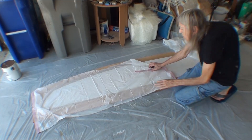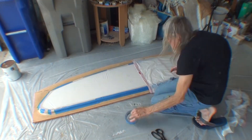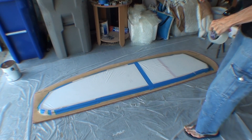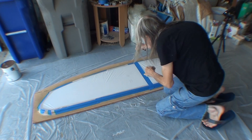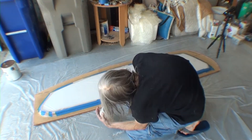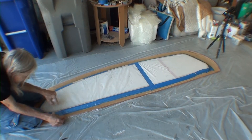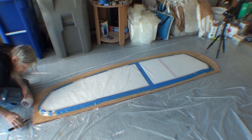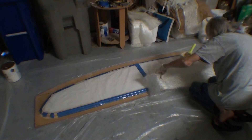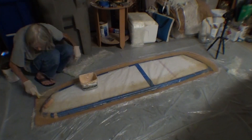I'm going to use a trash bag and some packing tape to seal this, and then it will be used as a mold to make the next piece — the piece that the window will actually go in. It'll conform to curve over this flange on all sides and hold the window in the middle, and up above it should stick out enough to hold the hinge. I'm making sure that the packing tape overlaps and that every place is covered with packing tape. And once that's done, I'm laying up fiberglass over that piece that I just finished.